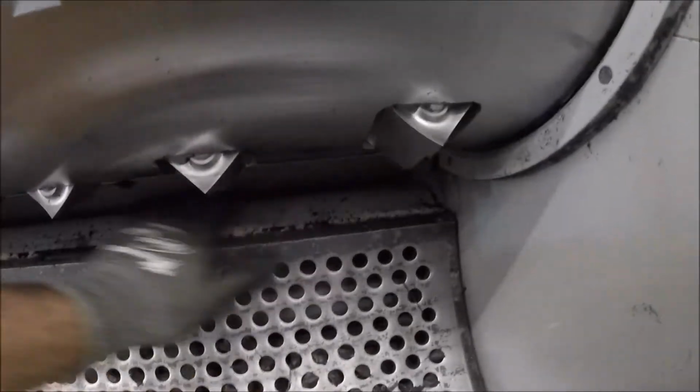Then once the screen's out, you take off all the material that hangs up in the back here. So I'm going through all this stuff, but the screen will be out. You're going to get all this material out of these angles and your hang-ups here and here, and then let it just drop down and vacuum out. But you can see it's fairly easy to get to almost all the crevices on these knives, and then it's just a strong vacuum and a swipper brush. Bring it along here, and it cleans off any material that can be on your back screen support in that location. From doing this, you get the whole front and back end of the shredder cleaned of its material.